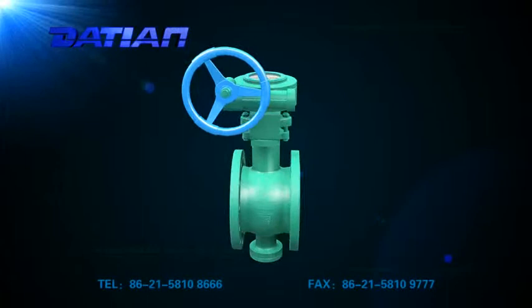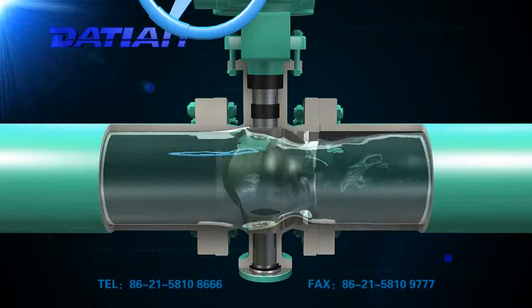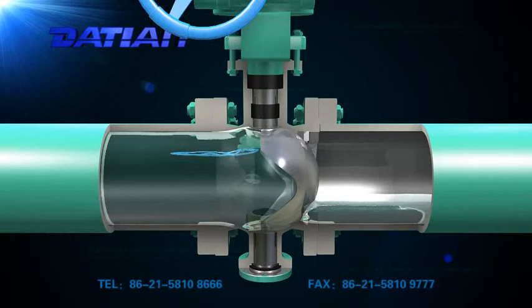3. The leak-proof durable seat is lined by an outer PTFE cap-shaped or O-shaped seal ring with stainless steel inside. It is made of large interface cobalt-bonded tungsten carbide with an alloy spring to enhance strength.